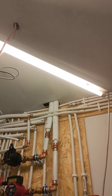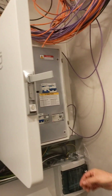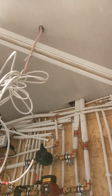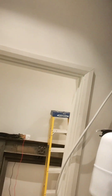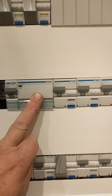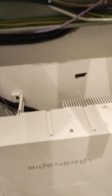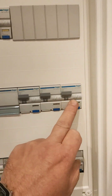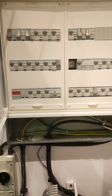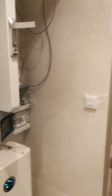So as not to run the batteries down, we definitely want to disconnect all of our non-essential loads. We've plugged in a fluorescent light up there which is on our non-essential, and our main ceiling lights up there are on our essential. Do you want to do the ultimate test - go into island mode? Ready to go. As you can see the fluorescent light has gone out because it's on the non-essential loads. The lights in the hallway are still on, sockets are still on, fridges are still on. The contactor has clicked out through the failure of the mains power, giving us much more battery life. It's also important to have all your fuses that are higher value than the fuse of the actual solar PV system - which is a B25 - disconnected in order to give us enough inrush current to successfully trip any fuses if there is a fault in island mode.